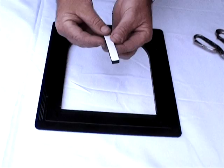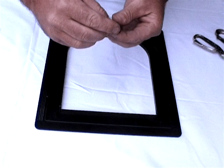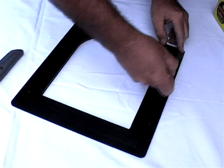When fitting to a stainless steel mesh door, a one-sided sticky back foam insert is required to take up the cavity between the mesh and the pet door frame. This is available from your local hardware store. Starting 10 mm in from the edge of the frame, peel off the tape and stick the foam to the relevant edges of both the front and the back frames.